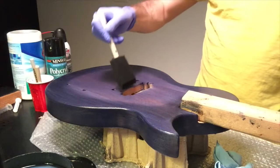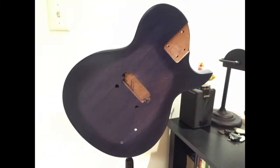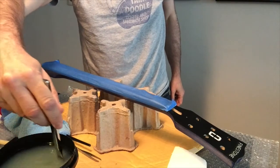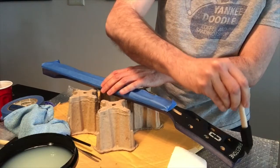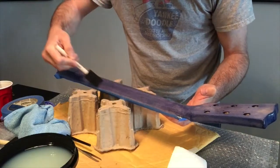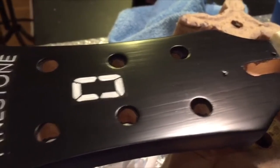When I was done, it ended up being five coats total. It looked pretty good — time to put it up and let it cure. You're supposed to give it a day per layer, so that's five or six days. Stir up the Bright Tone — don't shake it, you don't want any bubbles. I then did the headstock first, putting about four or five clear coats on there as well. In about a week it'll be time to put the hardware on and attach the neck to the body, so I'll see you next time. Goodbye.